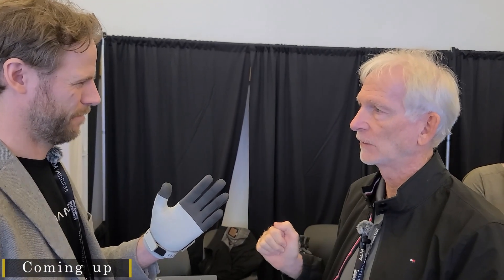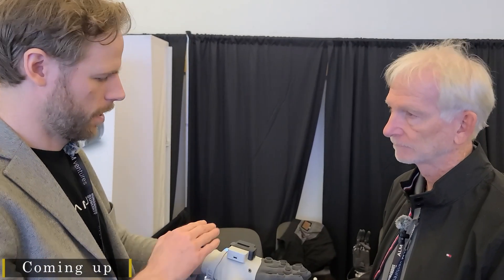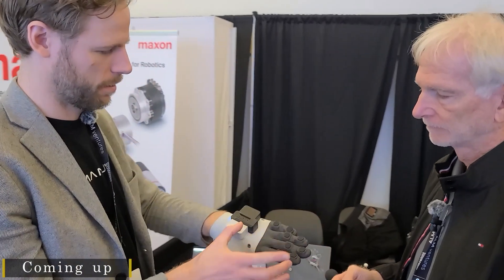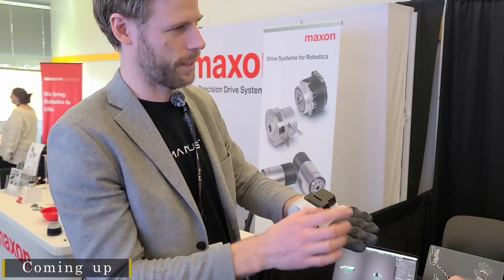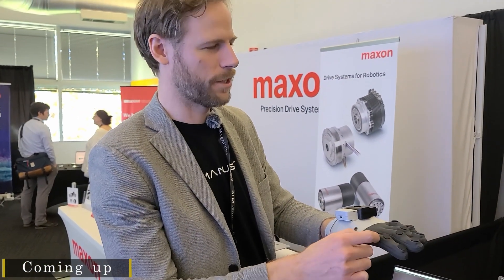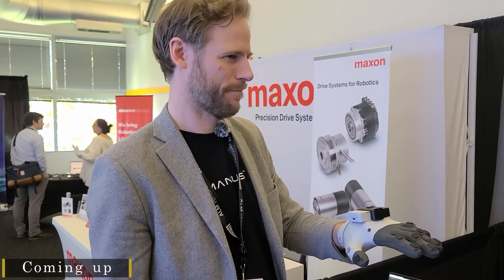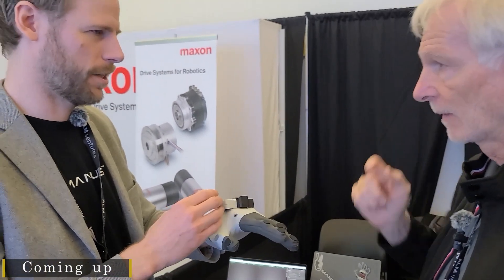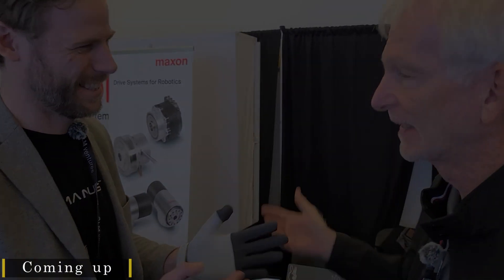Almost everyone's hand is the same as far as bone structure, but the lengths are all different. So how do you calibrate from one hand to another? When we do the calibration steps, it consists of four different motions — one is laying it completely flat. Because we know the distance between a source and a sensor, we can measure for each individual finger what the length is. That feeds into our inverse kinematic system to know the joint angle of each individual link in that chain. We utilize something called the golden ratio — the Fibonacci sequence — exactly.